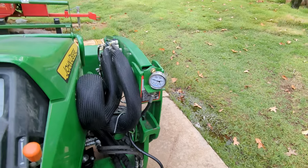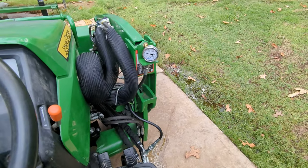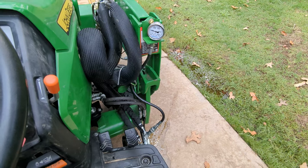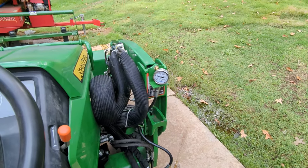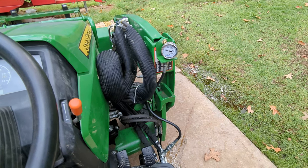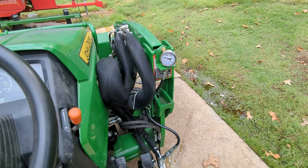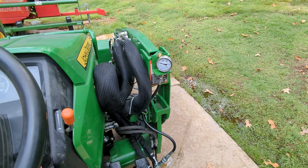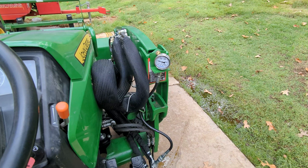It will be set up for John Deere quick connects. You'll see I have a quick connect on the prototype, but that's not going to be in the final product since it just adds cost and isn't really necessary — it's just how I put the prototype together since I'm taking it on and off a lot. The final product is really just going to be a gauge, a bracket, a hose, and a T-fitting. Unfortunately, the T-fitting that works with John Deere connections is extraordinarily expensive — I think it's because hardly anybody uses them and not many are made, versus something ubiquitous which can be surprisingly cheap.